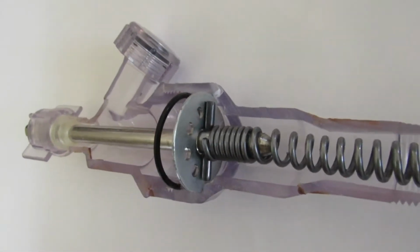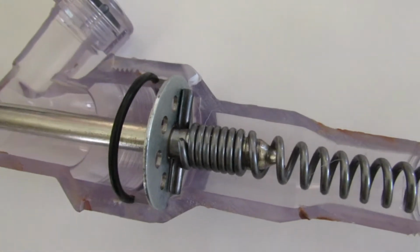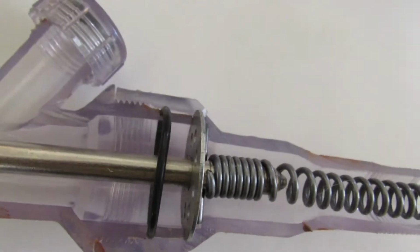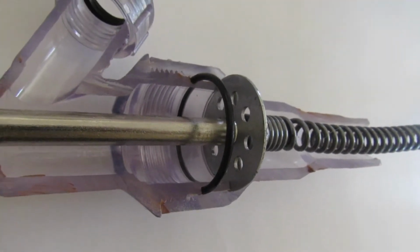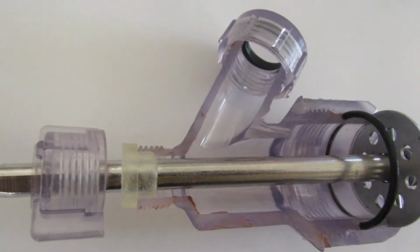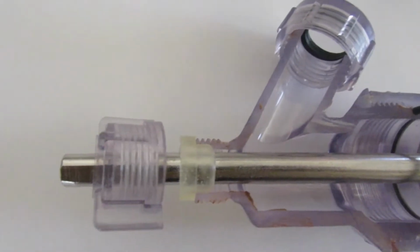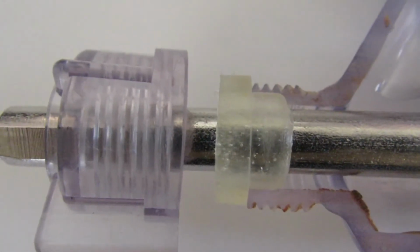The clear plastic housing is made up of two parts screwed together. An O-ring creates a seal between them. The shaft has a seal too that's facing inward. The seal nut is adjustable. Make sure to monitor it during use so that it doesn't over-tighten. A little leakage is okay. Lubricate the O-ring and shaft seal with oil or grease before each use.